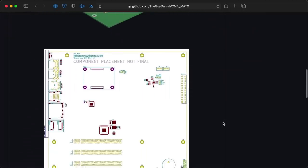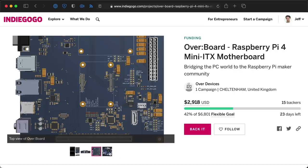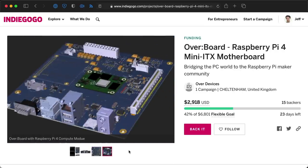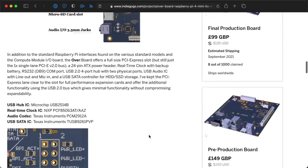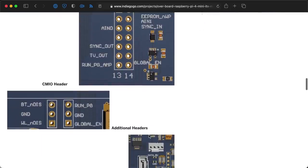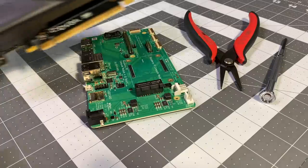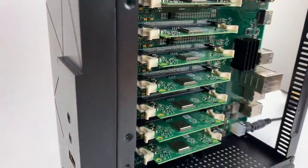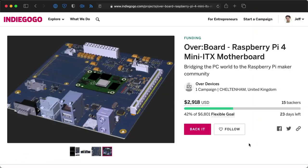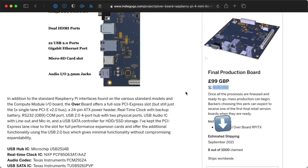In my first CM4 board video, I mentioned an open-source micro-ATX carrier board for the compute module, which is still being designed. Well, Ross Nichols decided to go another step down in size and design a mini-ITX carrier board, meaning there will be another option for building the Pi into a full desktop ARM-based PC. The board has pretty much every possible connector exposed, and even includes an internal SATA port, though the port is tied to USB 2, so unless you use a PCI card, you're going to get a slower hard drive speed. My favorite feature on this board is the full-size 16x PCI Express slot — it makes it a lot easier to physically plug in larger cards, even if they run a little slower on the Pi's 1x bus. The Overboard is listed on Indiegogo, and the target price is around $140 USD, available around September this year.